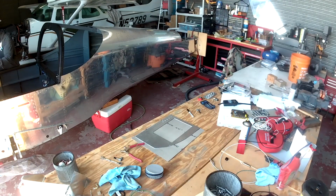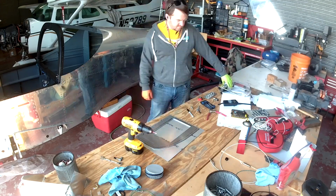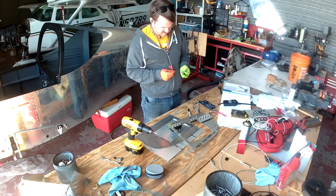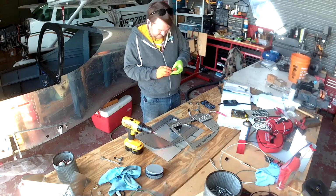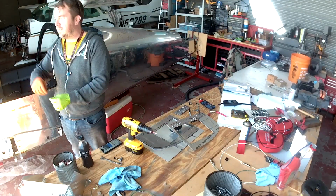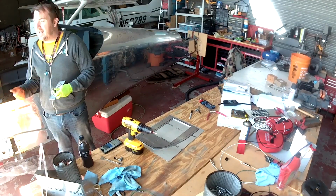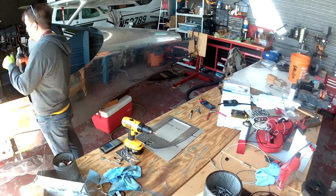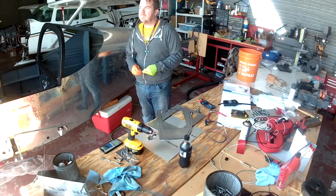So we're just taking some extra aluminum. I ordered a few pieces of some 60 thousandths tempered, and we are making some more beefy and sweet versions. Actually, starting with the one that you see right there. That was the one I was working on last week, and I said that I'd start fiddling with some switches that were also breakers. Well, those are in, and I'm going to use those. I'm going to be using breaker switches for things like taxi and landing lights and navs and strobes, because extra 5 amp breakers for no reason just seem ridiculous.